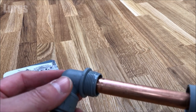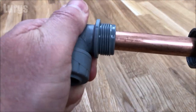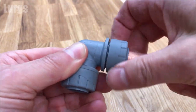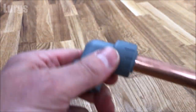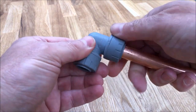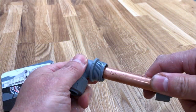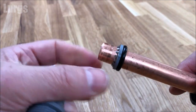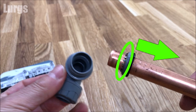Just push it in nice and parallel, push it as deep as you can get it, and then just tighten it up. You only need to do these hand tight — as tight as you can get it. Obviously to remove it, you unscrew it anti-clockwise and then you can just pull the pipe out. This will pull out the innards as well. If you need to reseat this, slide these components off to the right-hand side. You've got this grab ring at the end — you can reuse that, but I would recommend removing it and replacing it with a new one.